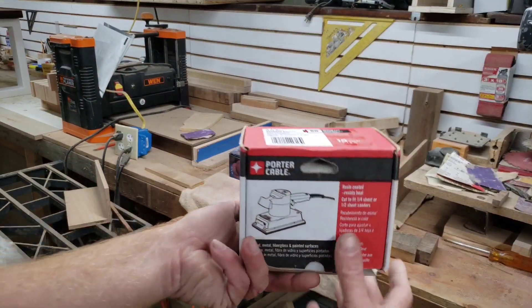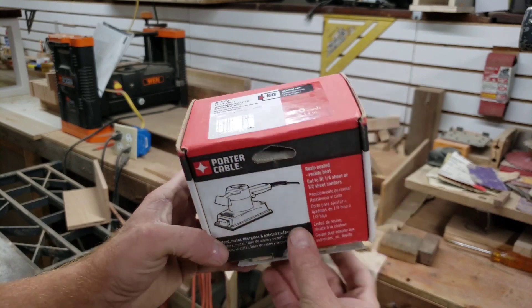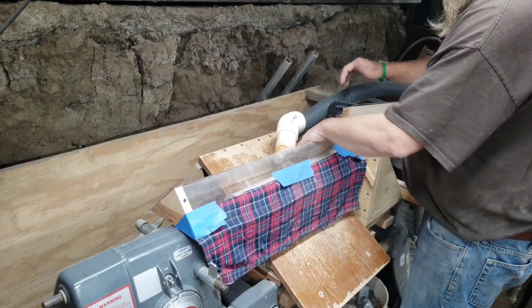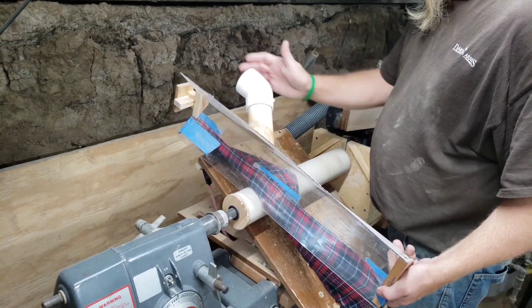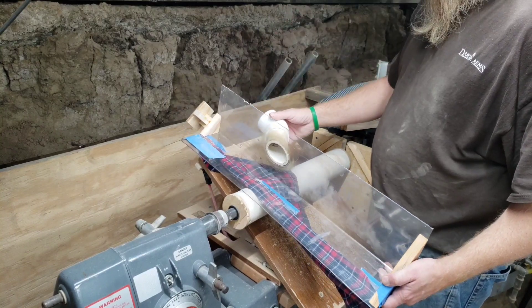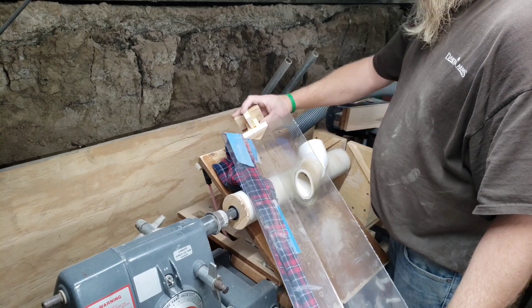I get this sandpaper on Amazon. It's actually four and a half inches wide and 30 feet long, so that gives me about ten cycles of paper on this drum for about 25 bucks. A little bit more about the unit — I built the dust collection in the last video. It's just a piece of eighth-inch Lexan that I've added a PVC tube on a PVC elbow, heated it up so it would fit my intake to my shop vac, and a couple little wooden widgets to secure to the top of the Shop Smith.